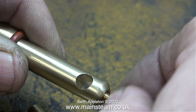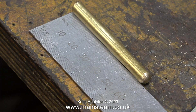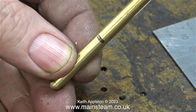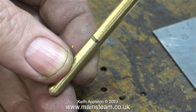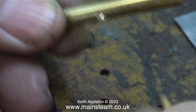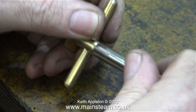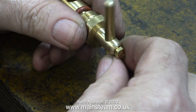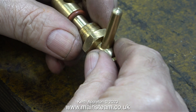The bolt fits in the hole but it's not as tight as I would like it to be. The next part of the job is to make the handle. I've cut a piece of quarter-inch brass, put it in the lathe and rounded the ends. It ended up being 60mm and in the centre I made a mark at 30mm, to allow me to drill a hole in that position. Why go to all this trouble of drilling a hole in the centre? Why not just use Loctite 603 or silver solder it? The answer is quite simple — on the shaft is an O-ring, and it would be quite difficult to remove the O-ring if the handle was a permanent fixture. This clip shows the O-ring in position, and I have of course fitted the gland nut before fitting the handle.